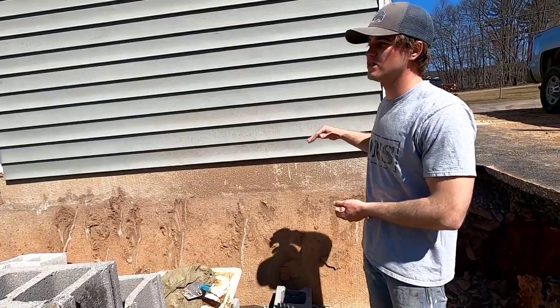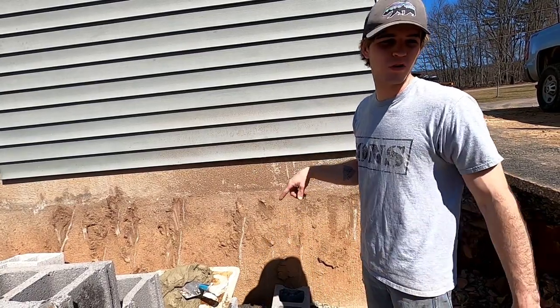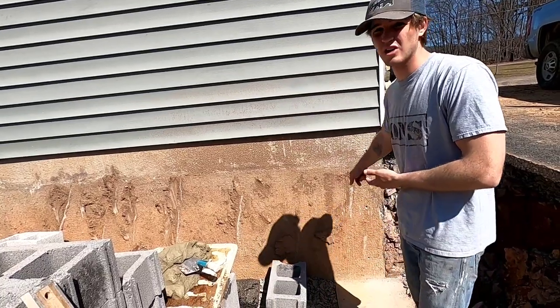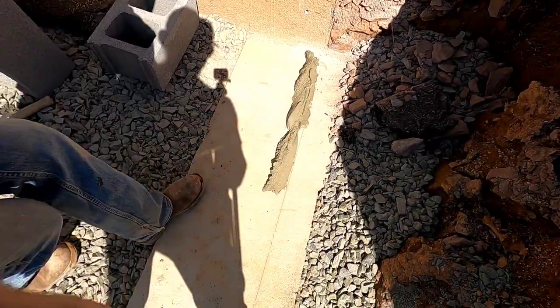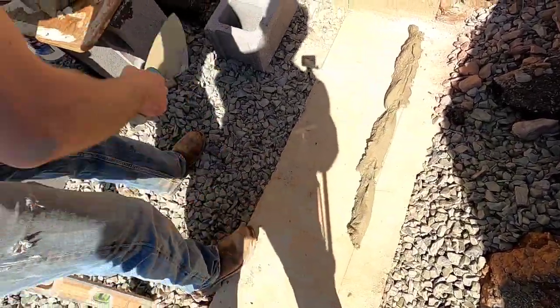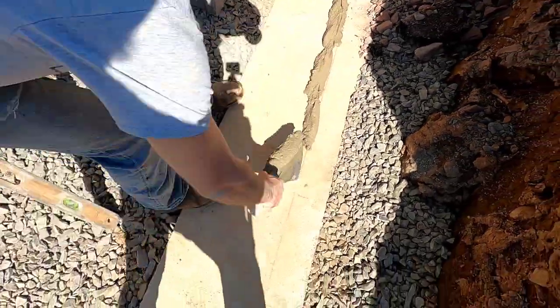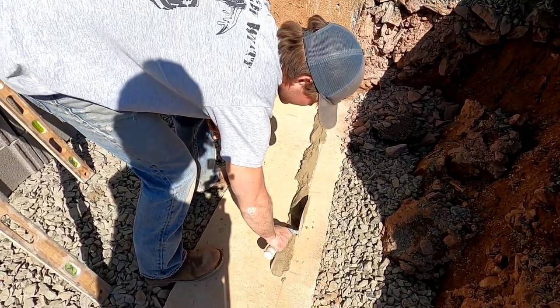I know I'm coming up six courses. When you do a corner you do six on the bottom, but I'm not doing a full corner so I only have to do half — come out three block. Put mud on half of it, flick right along my line just like this — half my trowel, flick. I have my bond marks made, so one, two — I only have to come out to here. Make sure you're not covering them, very important.